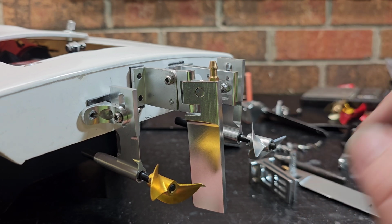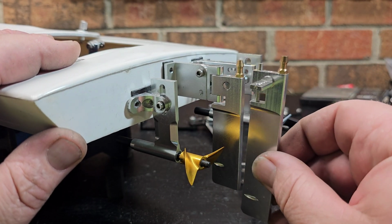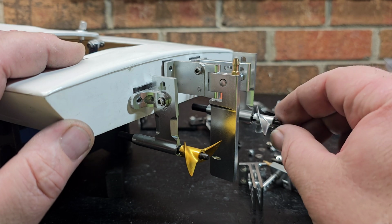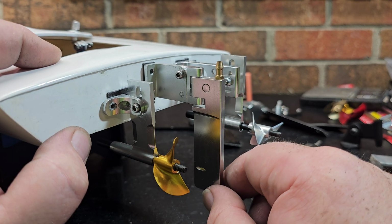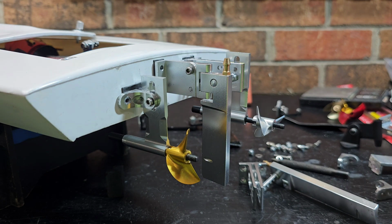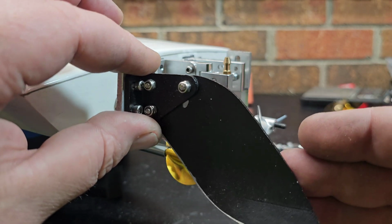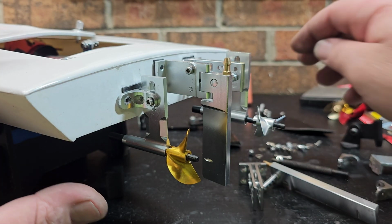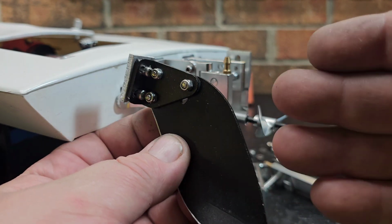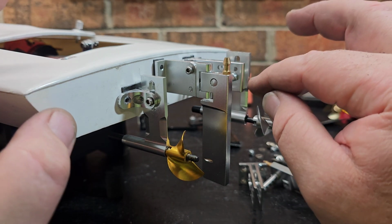I think I'm going to go with the extended strut, rudder in front of the prop. If we need more steering authority, we can use the longer rudder to get more rudder in the water, because with the props behind the rudder, it's going to want to blow out, and we're going to understeer. I'm afraid if we put the rudder behind the prop, it's going to oversteer, especially in a turn. The blast off the propellers hitting the rudder is going to create an oversteer effect with the turn fin. That's what I'm thinking. So with a hydroplane, I'm thinking having an understeer effect in conjunction with the turn fin. It should be kind of on the money. That's what I'm hoping. So extended struts, final answer.